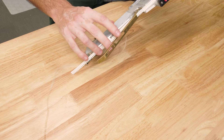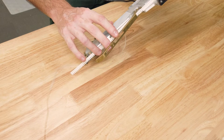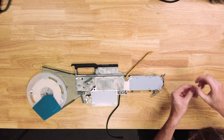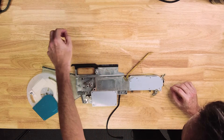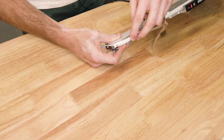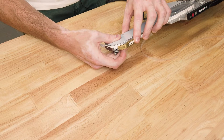You can see there's a window in the guide here. I like to pull the tape along until the first component is about in the middle. Peel the film back to about that same spot and feed the film through that window. Then seat the tape onto the sprocket and close the guide with a push.